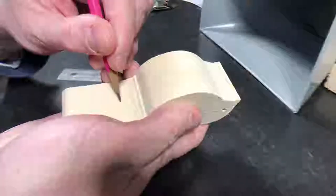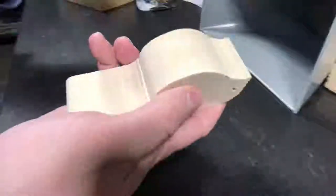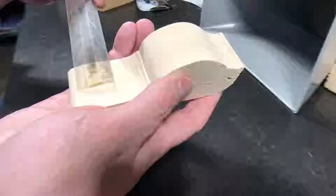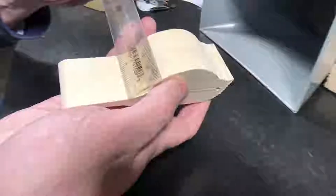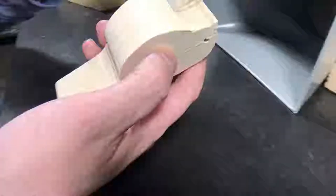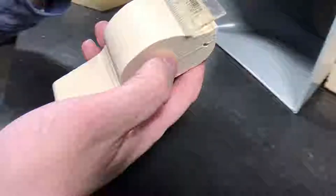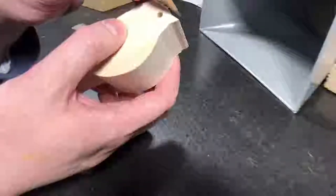Do check it every time, because these are your guidelines. As you're carving the bird and taking away wood, this line is going to disappear and you'll redraw it again and again. This line has to be really clear because it's your north star — it guides you as you work through the bird. When you get into wilder stuff — the wing moved up on one side, the head turned — this will always keep your feet on the ground.